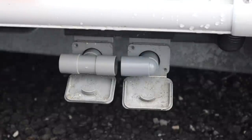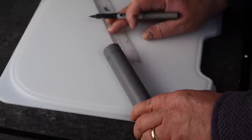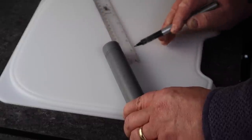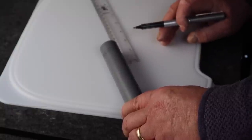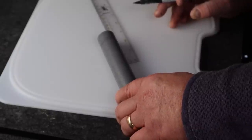So we need to take that measurement and add it onto the other two - that's our total length that we need to cut. Let's plot it out to make sure we've got it right: we've got 18mm there, 23mm there, plus the 10mm gap. So 10 plus 18 is 28, plus 23 - that's 51mm. I'm sure I've got that right - no doubt if I've got it wrong you'll tell me in the comments below.